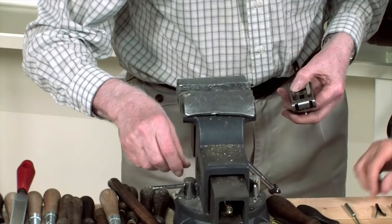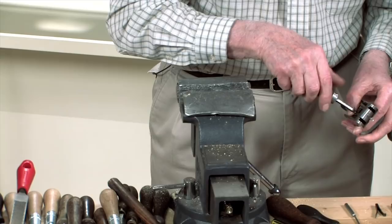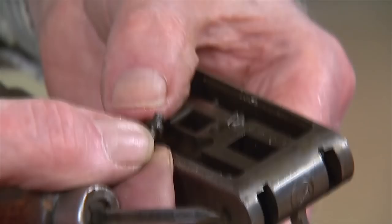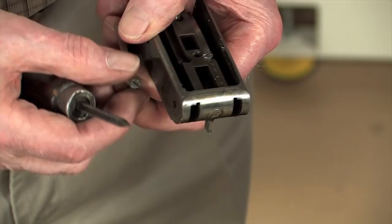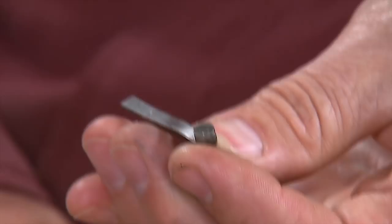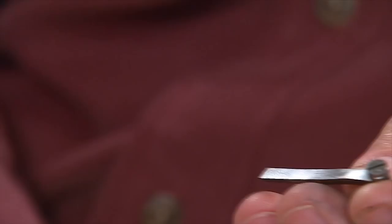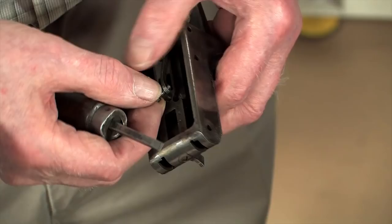And last of all, you can take out your sear spring and pins. Now you'll find that these are usually marked with a cut on the bottom or a dot on the top. This one has got a little dot on the top — that's the left-hand side one. There's a dot here on the left. That signifies it's on the left. The dot would be left. The English always mark the left-hand side.